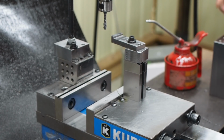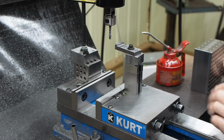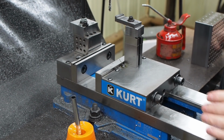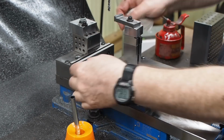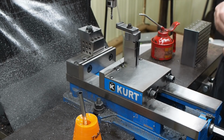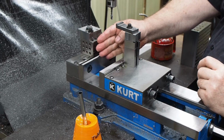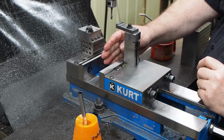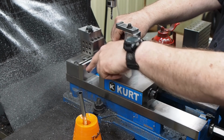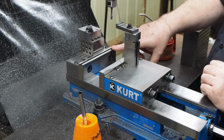You can look at some of our videos and you can see that I've altered this vise. This Kurt vise, when I got it brand new, after I checked it out and made sure everything was working good, I pulled it all apart and I re-ground everything. I ground the jaws, I ground this base, I ground the bottom. I added some 3/8 holes back here because it just has 2 nice big bolts coming up from the bottom that hold this down. I wanted some pressure holding from this direction as well, because when you tighten this vise, the jaws would actually move and distort. So you can have a perfectly square block in there, and if you're not holding it right, it would distort on you, and it's no longer square. If you hold your work on the ends without having something of equal thickness on this side, it distorts in a couple ways, and we've done some YouTube videos on here.